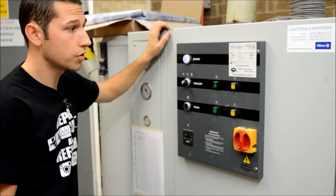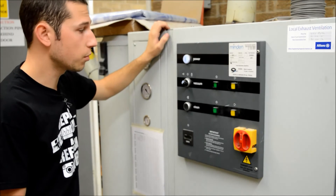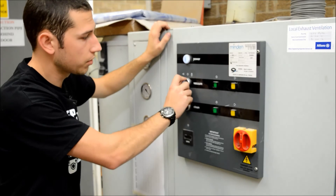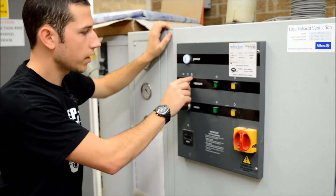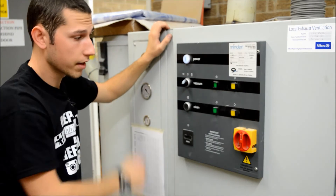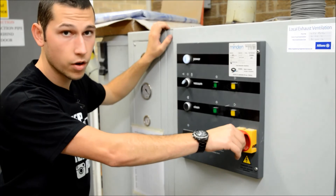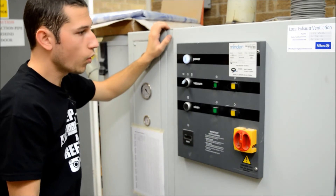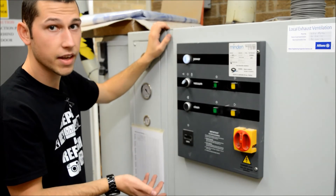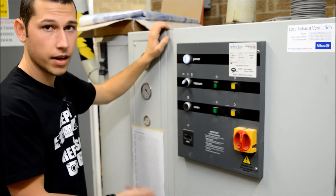So here's our static extraction unit for all our workshops. As you can see we've only got a few controls on it. On these main controls we've got an on/off switch, a permanently-on switch, and a remote switch which goes back to the remotes on the pods. We've also got a clean function and the main master on/off switch. While we're on the controls, I'm going to put it through the clean cycle so you'll be able to see and hear what it's doing - all it's doing is blasting air through the filters and keeping everything clean inside the unit.